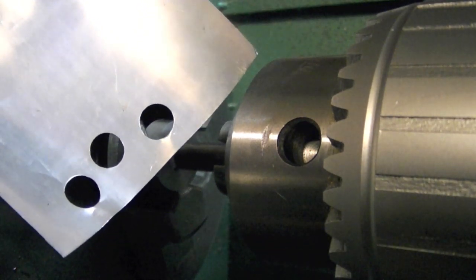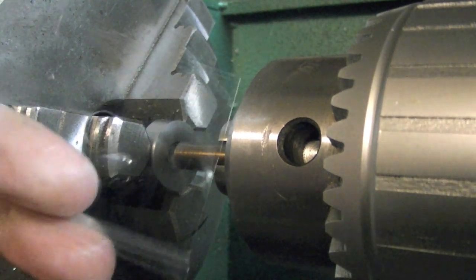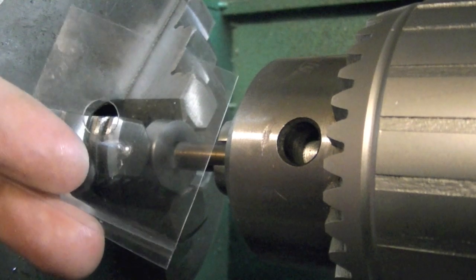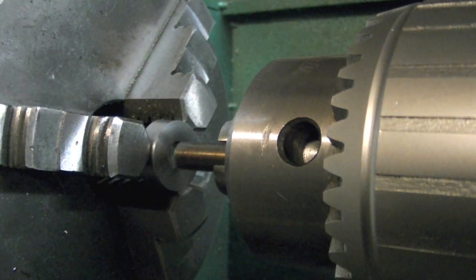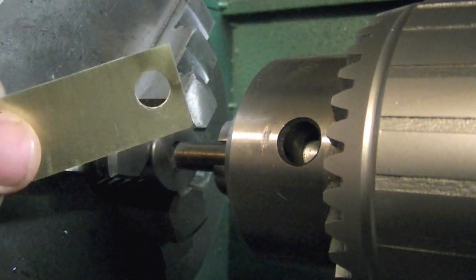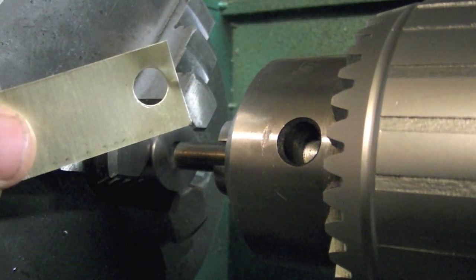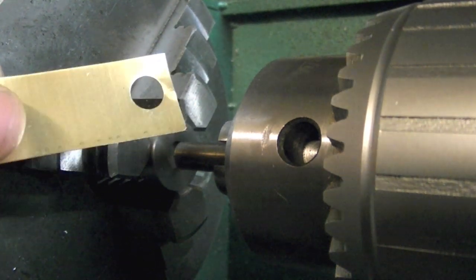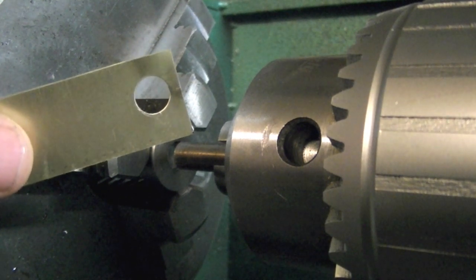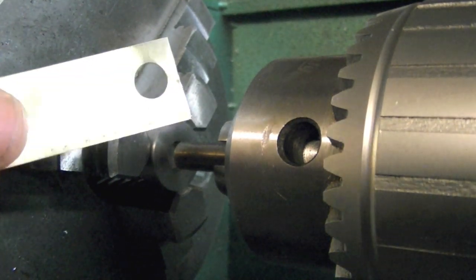This works with aluminum, as I just showed you, and it also works with plastic — this plastic is about fifteen thousandths of an inch; it stretches a little bit, so that can be a problem, but you could pick a different plastic. And this brass is ten thousandths of an inch thick. You can see it puckered, and I did this brass this afternoon after I'd removed the die from the chuck. I'm not sure it would pucker quite as bad if the die and punch were centered perfectly, but this is a homebrew punch after all, so I'm pretty happy with those results.